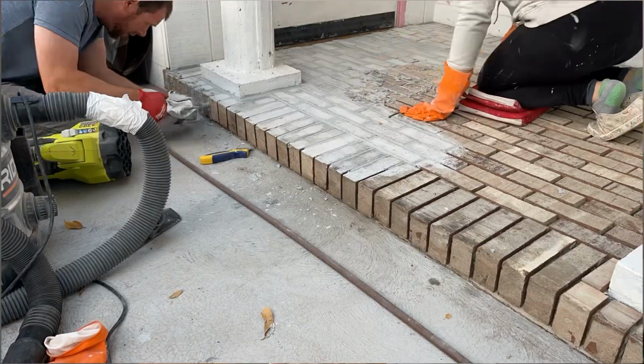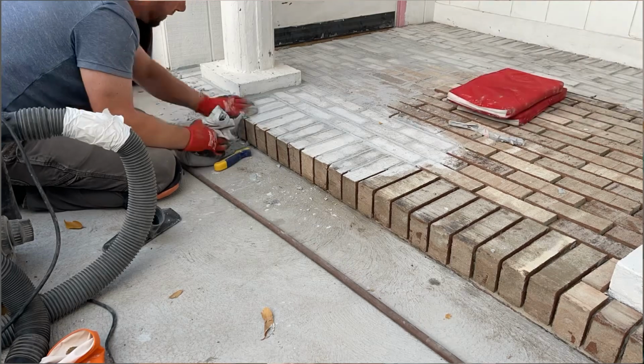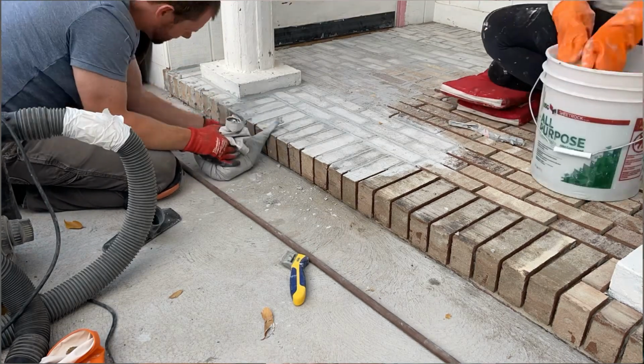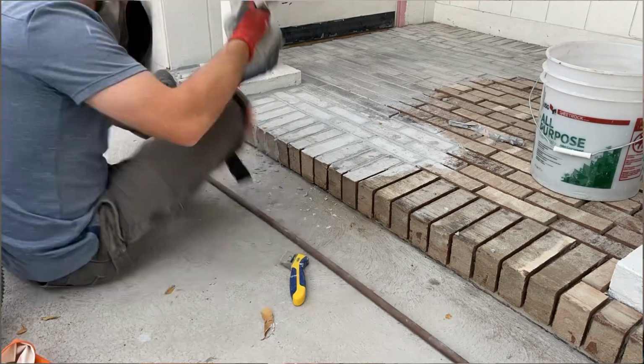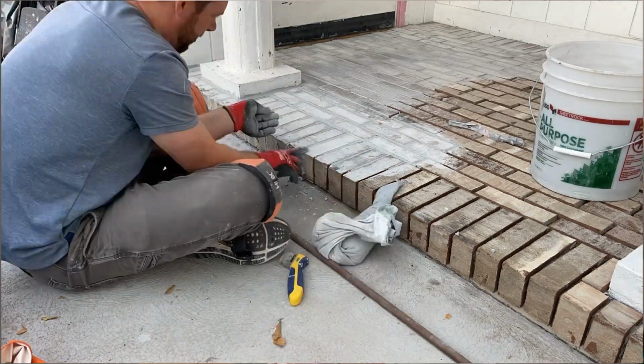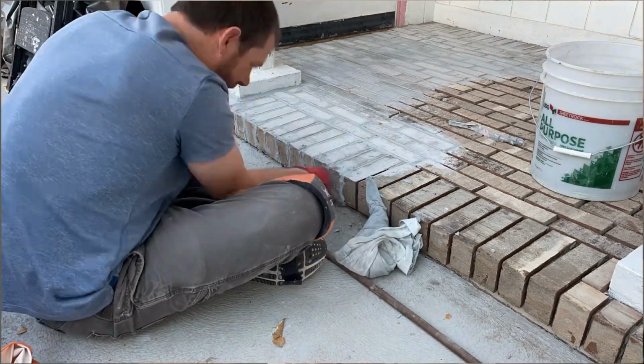Grouting, what was tricky with it was your hand gets really tired pushing the grout out of the piping bag, and you need to make sure to clean the bag with your bucket of water between the times you use it, or else the tip can get hard and crusty and then it's even harder to get stuff out of it.